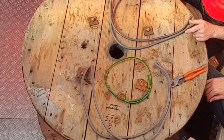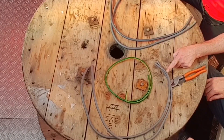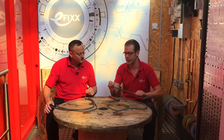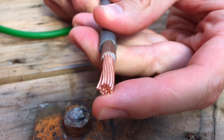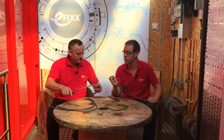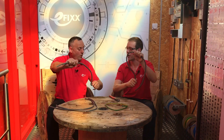When we were at Doncaster Cables, they suggested a product that was going to make electricians' lives easier. From the outside the product looks exactly the same - no visible difference between the two. It's when you get inside the product that we start to see the real difference, because inside, instead of the usual seven copper strands, we've got 19 copper strands.